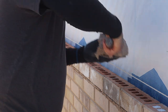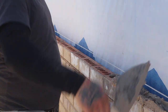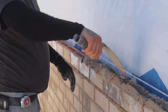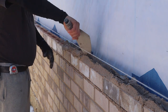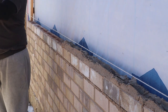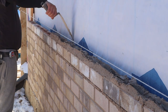Not just to use the mortar in the middle, you gotta use all the mortar around the board. If you only take from the middle, the mortar's gonna start getting harder around the edges, and it's not gonna have consistency. This way, you keep it consistent. Sweep it up, clean it up. And judge how much mortar you need to spread.